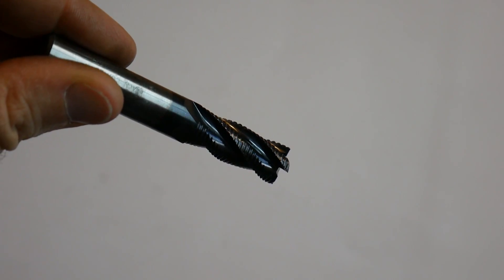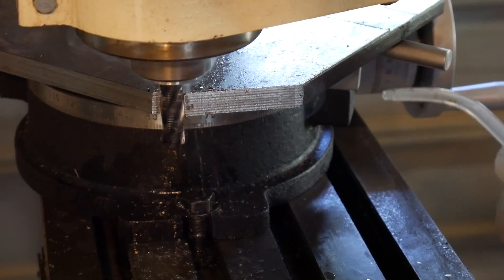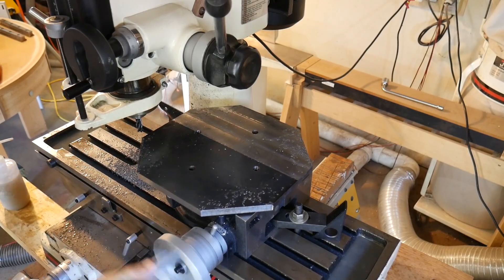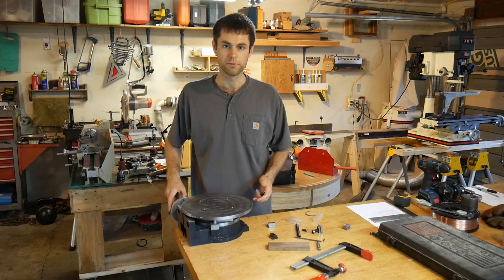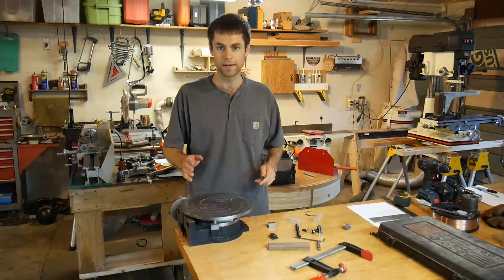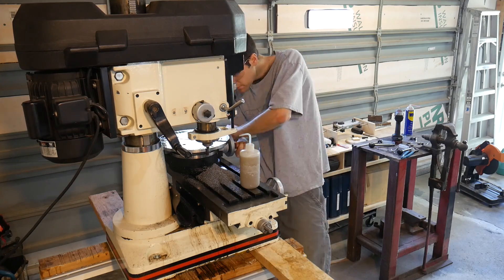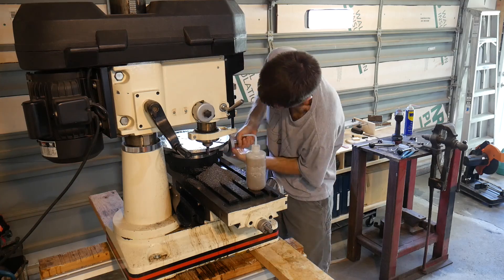Since I didn't have the torch available, I took my roughing mill and ran it around the side. I started with the square corners, took it down to an octagon, and then just started cranking and milling off the edges. Cranking was fairly difficult, so I ended up using some odd body mechanics, trying to use my body weight. This ended up being about 2 hours of just cranking, which was a lot of work.